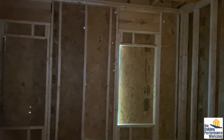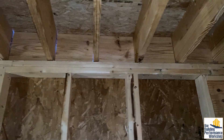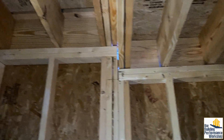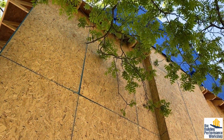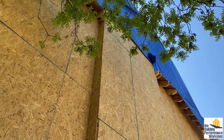The reason we're conducting this experiment is to show the difference between typical OSB installation. Most builders install it like this and the only thing they do on the outside is put a house wrap. What we're trying to show is that if you air seal from the outside instead of trying to air seal from the inside, it's better. So we're going to seal all these seams, the bottom plates, the crawl space, the attic, the roof line, and basically spray a coating called Thermacoat on top of this. That coating becomes our weather-resistant barrier.